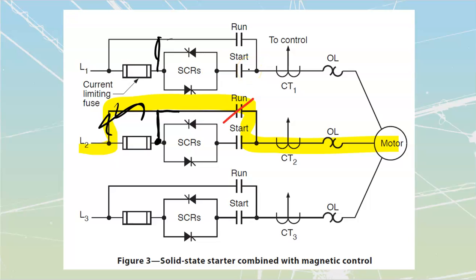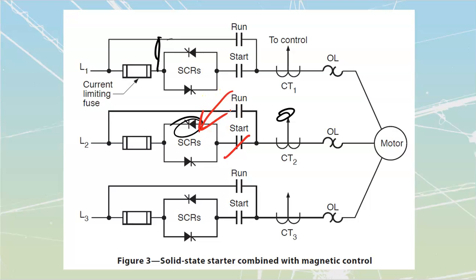Bring those lines all the way back down, and you'll see we've got a closed transition we can go to. This is really good because then we're not running current through the SCRs — we can shut off the triggering and only need to run the semiconductor circuits monitoring the CTs and SCRs during startup. For the rest, the CTs just monitor the current going out, and any overload condition transitions us in a closed state to shut things down, ramping back on the SCRs.